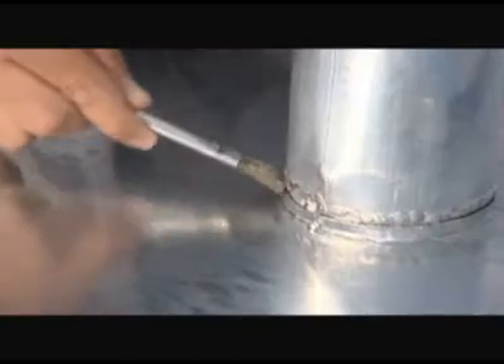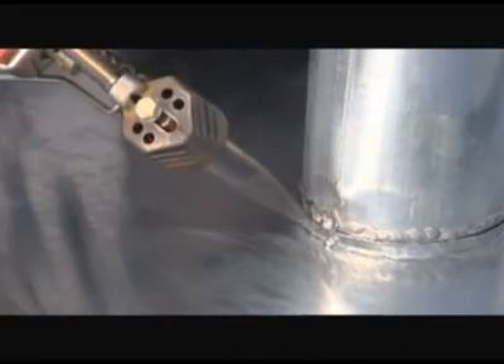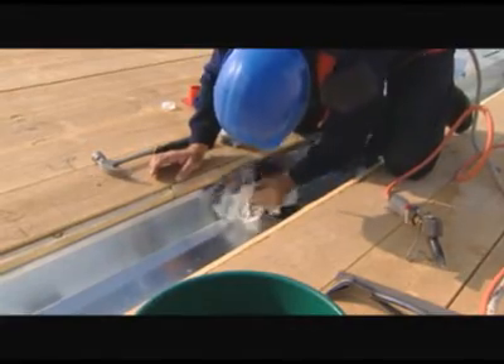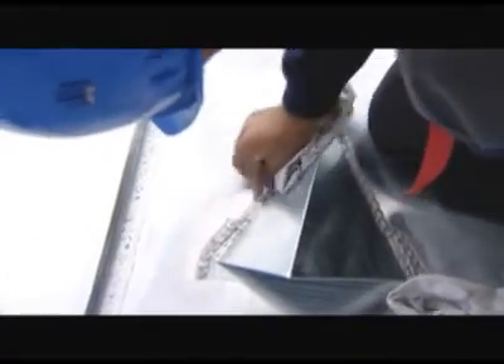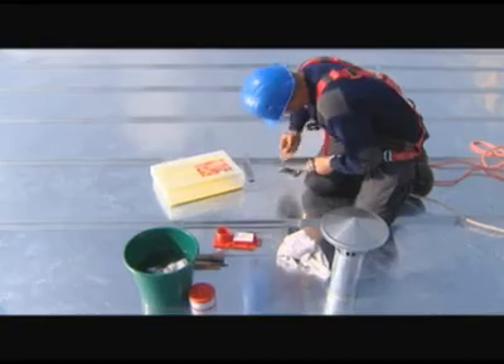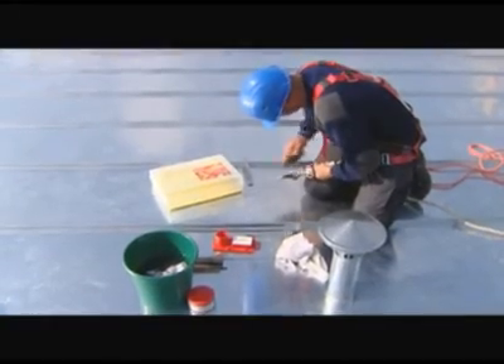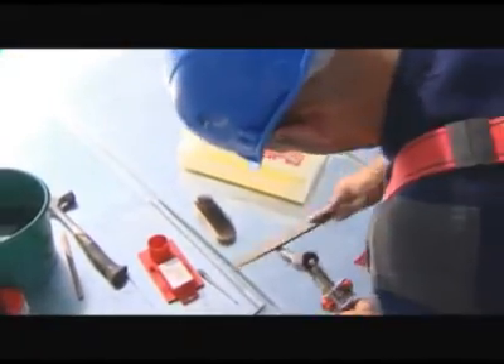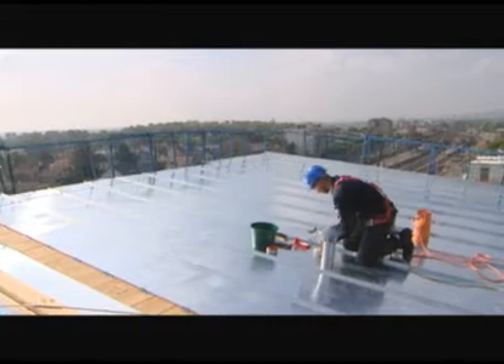The overlap of the two parts to be soldered must never be allowed to get wet, as liquefied soldering metal explodes when it makes contact with water. Rub the soldered parts with a clean, damp cloth immediately after soldering, then with a dry cloth. It is important to clean the parts that have been soldered so as to eliminate any trace of acid or ammonia. Stripping and degreasing are imperative for good soldering. Clean the head of your Express soldering iron and tidy all elements.